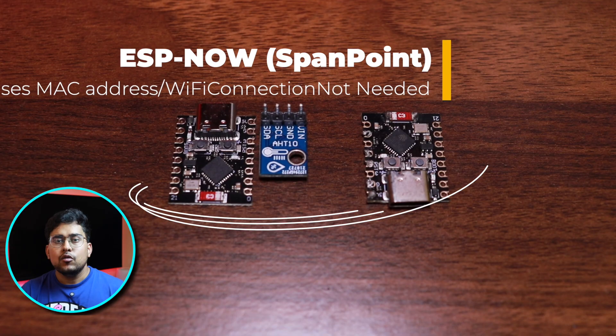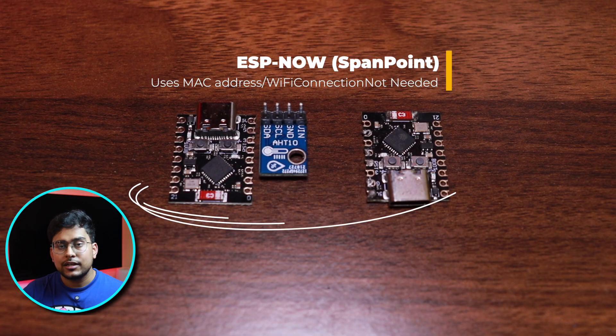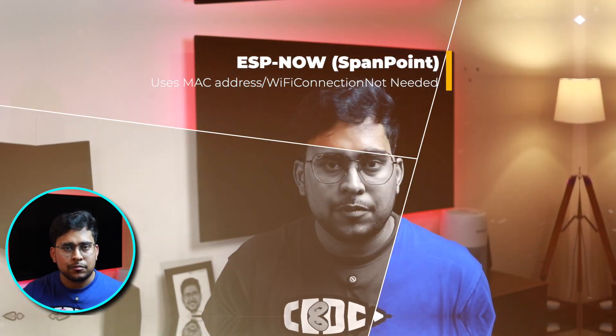This hub costs just $1.75, compared to a commercially available hub at $60, while commercial sensors range from $20 to $100. The transmitter sends data via the ESP-NOW protocol using the MAC address of the receiver — no WiFi connection needed — so it's very quick, low power, and remains in deep sleep for most of the time. You can also adjust the deep sleep duration or add an external button interrupt depending on what kind of sensor you are creating.